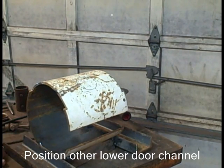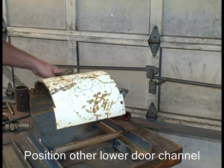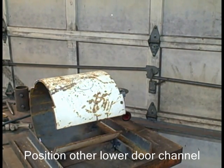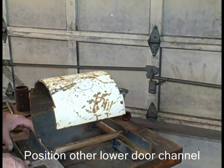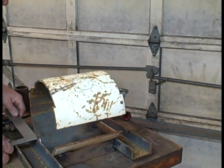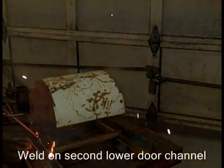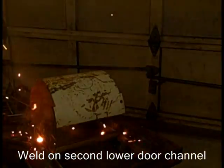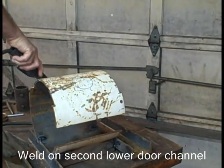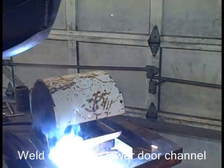Position the other lower door channel. You can see also that I did more cutting so that my channels go into the body. I cut little slots out for it so that it makes lining it easier. I have less unevenness to deal with. I didn't videotape that when I did those cuts. You don't have to do them. This is the first forge I've done them on, but I believe it'll make it easier to line it.